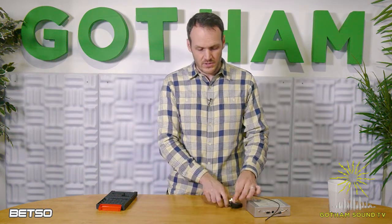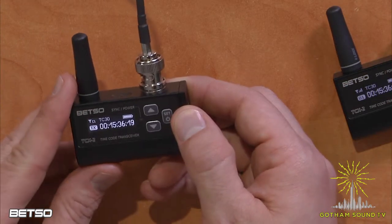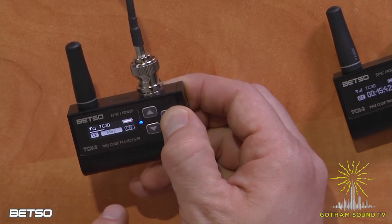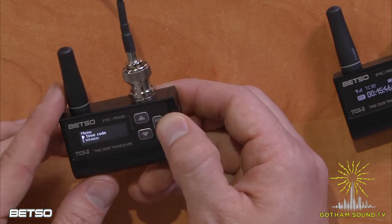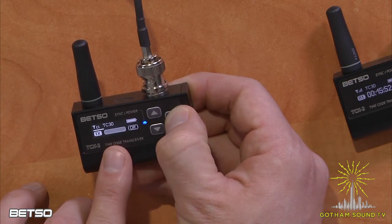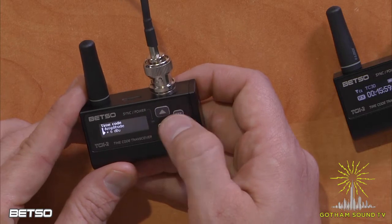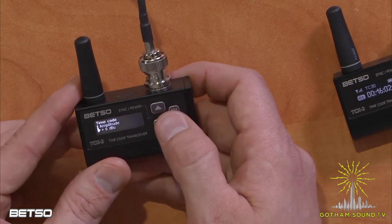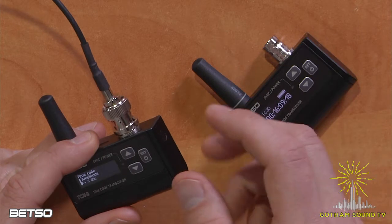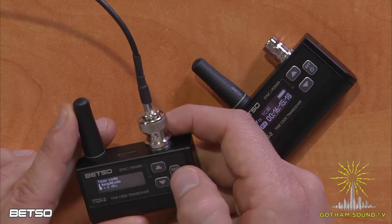In terms of how it works navigating the menus, I'm going to turn this one back on just so you can see it. It's pretty simple. Once it's jammed, you push and hold set. The thing that's a little bit tricky is you have to wait until the menu lights up — you let go when the menu button lights up, and then you're in the menu. You've got your timecode menu where you can set the timecode out. If you're going to use it with a professional camera, you're going to want it at plus six. If you're going to use it with a DSLR, which these are awesome for because they're so tiny, you probably want it to be much lower, like negative 20. You push and hold set to go back.